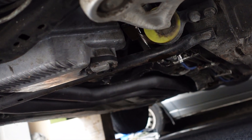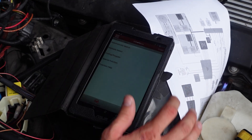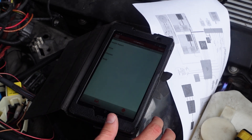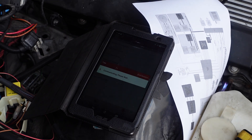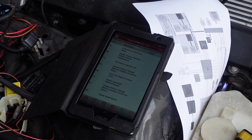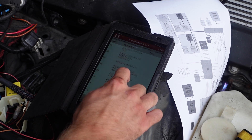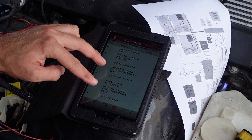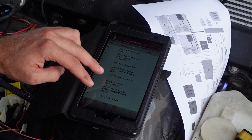After it was done, it was time to test it out. It looks like one of the fuel lines started leaking, which is something I'm gonna have to fix. For now, I just disconnected the fuel pump relay to stop the leak. I tested it again — it wouldn't automatically find the right car, but after putting in E46 and the MS43 ECU, which is what I have, I could read fault codes. Everything seemed pretty okay. There were only codes for things I don't have connected, like the electric fan, radiator water temperature, road speed signal, secondary O2 sensors, and the fuel pump. One thing I'll have to check is the exhaust camshaft position sensor, which may have something to do with that idle.